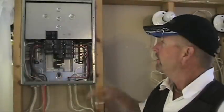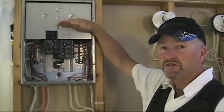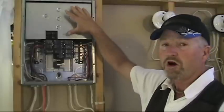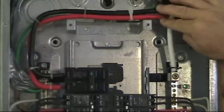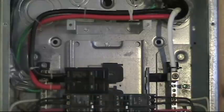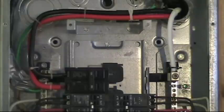I removed four screws that took off the main panel cover. First thing you're going to notice is there's a main compartment here that has another cover to it. Below here is the branch circuits; above here is your service entrance. The reason there's another cover is because anything here and above, you can't shut off without calling the utility because that comes hot right off the meter. These two wires come right off the meter base, feeds through the meter onto these wires onto the line lugs of the main breaker. In this case, it's a 100 amp two pole 240 volt breaker — outside for the home, it's a 200 amp breaker. The hot lugs are on the lugs on this breaker, and it feeds through and clamps onto the bus bar. When you turn that breaker on, it livens up all the bus bars down in your branch circuit compartment.